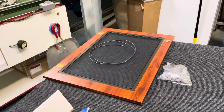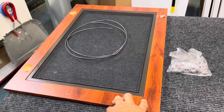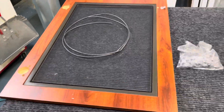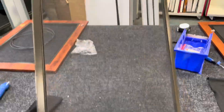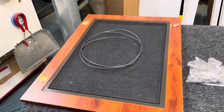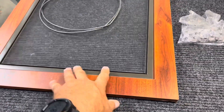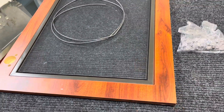The first thing we do is order a door that is cut for glass. When that door comes in, we then order a screen from J&J Glass — it's a shade screen or a regular replacement screen. We want to have about an eighth of an inch clearance in both directions so that it fits in the door but we've got room for it.